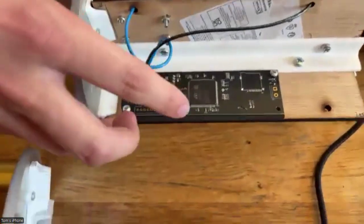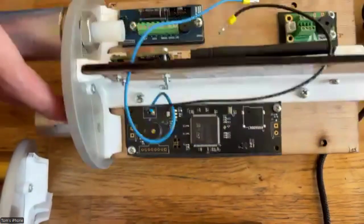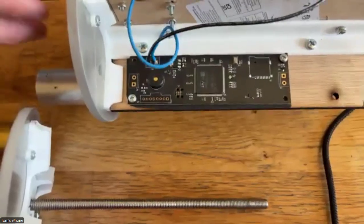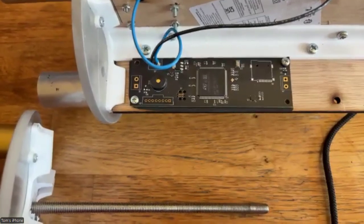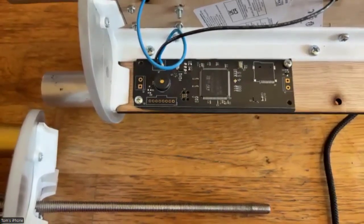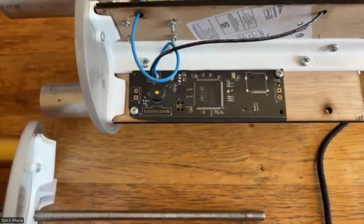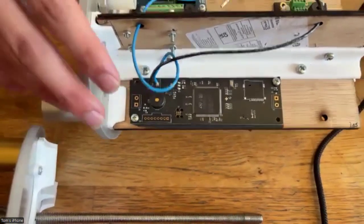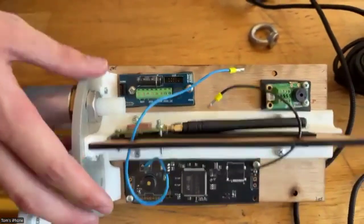And we obviously have a SRAD flight computer over here. Currently, we did some test flights, and it hasn't been fully successful yet. The flight computer was performing as expected, but on the way up, the battery holders we were using broke and we lost power, so we can't say that was the correct flight. So in the event that we don't get this flight tested before the competition, we will have it here as data logging, but we won't connect it to anything. And we'll instead use the two COTS components as primary and redundant flight computer.